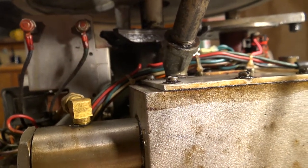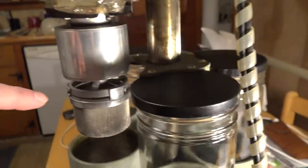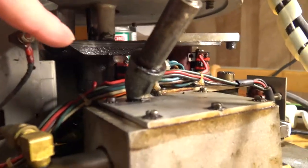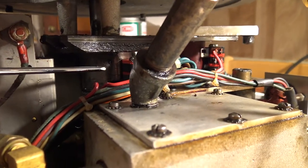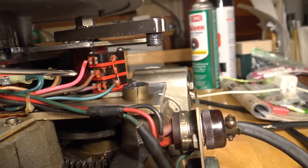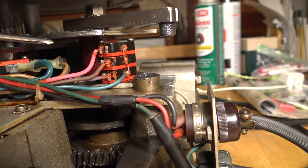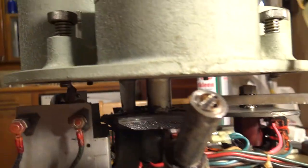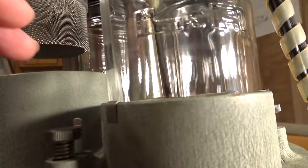It then turns off the pump and releases the hydraulic pressure so the basket drops into the jar. Then the switches turn on — there are two switches wired in series that operate the start and stop, knowing when the cycle is over. That turns the motor on again to sling off all of the solvent or cleaner in the jar, and then go to the next cycle.